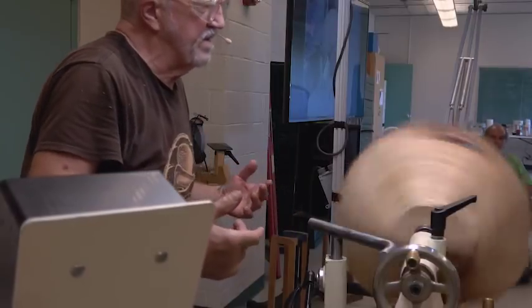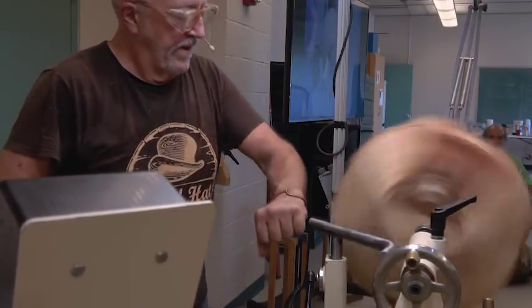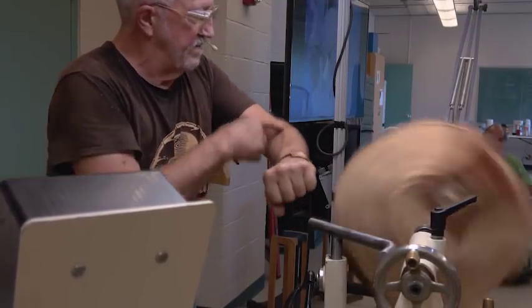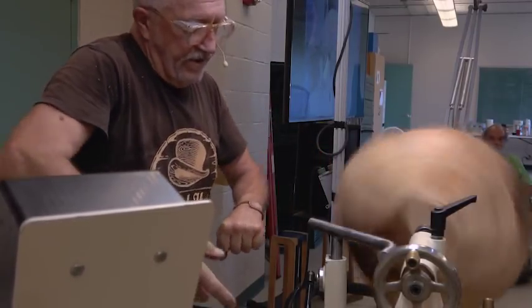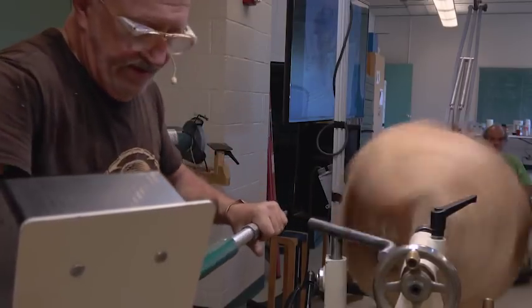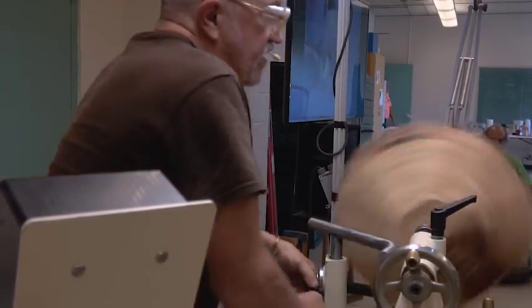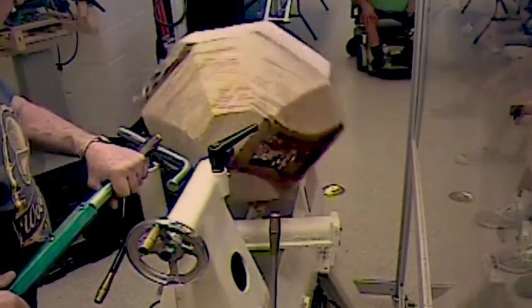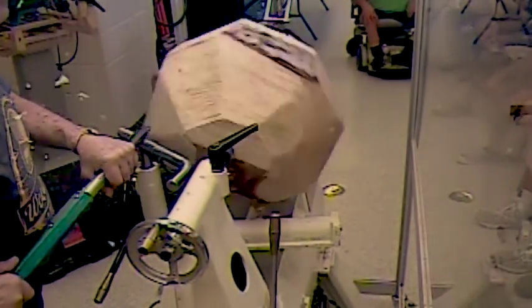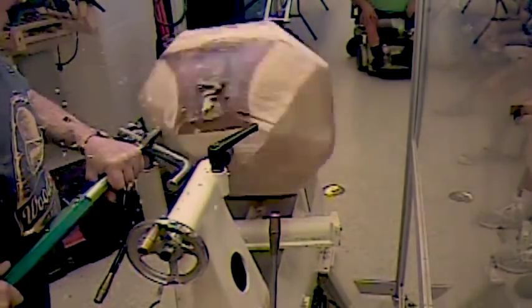If you use a 5/8 or 3/4 inch deep flute gouge for this work to get rid of all these bumps, all of that shock has to be absorbed by the poor little left arm all by itself, because this hand isn't doing much. This tool, you don't present it this way. You present it this way, and both your hands are behind it and all the force is driven down into the tool rest. So you want to make sure that's good and tight so it doesn't sink down. And this just chunks it away with very little effort. You're not fighting anything. It's all happy news.